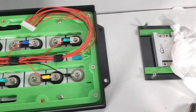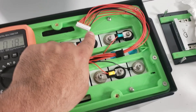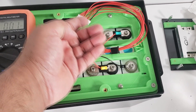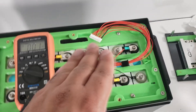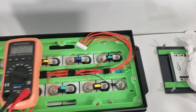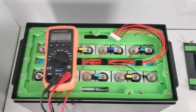Make sure you get a voltmeter and check your cells. From final negative to final positive, it should be around 26 volts. Then subsequently from negative to positive it should go 3.3, 6.6, 9.9, so on and so forth. Be sure to check that before going forward, because if you don't, you will fry your entire BMS — so it's not going to be a good day. Make sure everything is good. Once it's good, install the riser plate and then we'll move on.